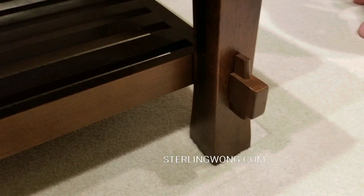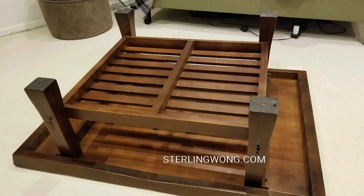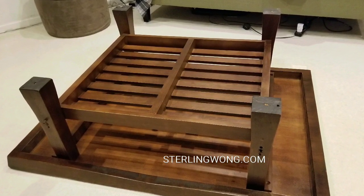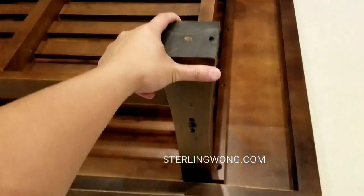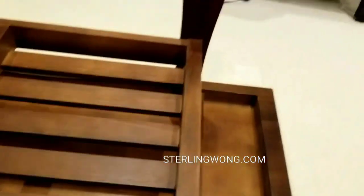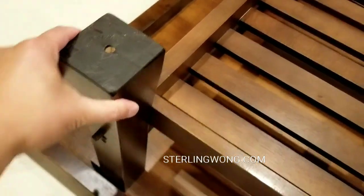You have to remove covers — there are screw covers that hide screw holes. Removing those covers by wiggling them off is good, but sometimes they might be glued on with wood glue. So you want to slowly nudge it until it loosens up. We normally don't glue those screw covers and just leave the dowels on there.